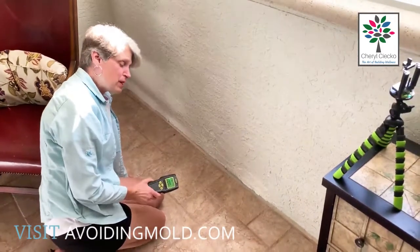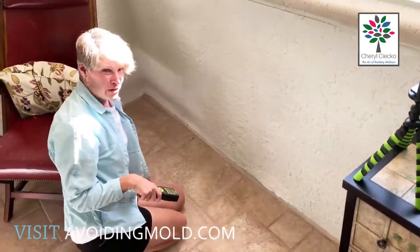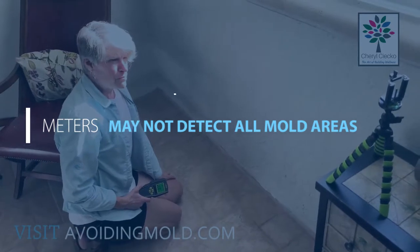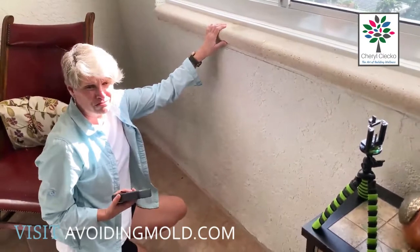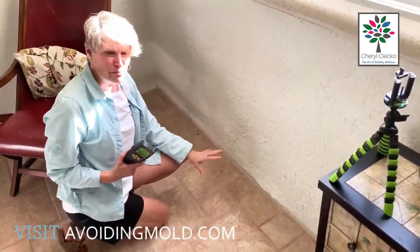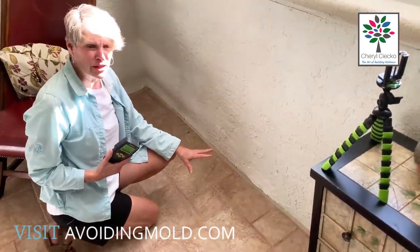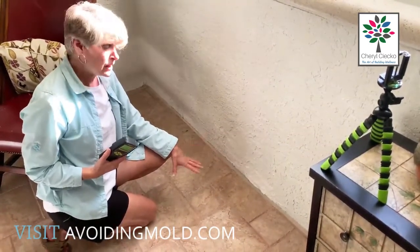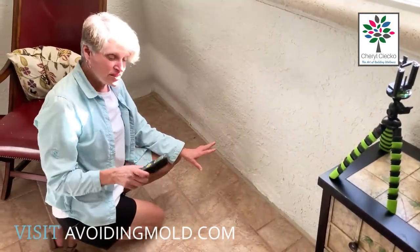Where this becomes a problem is when people have wood flooring on top of concrete, because under the wood flooring is an impermeable membrane of some sort that allows the wood to not take on moisture from the concrete. So if there was wood over this, it may not read significantly higher — it's really hard to test because of that impermeable membrane, which is often plastic or some sort of vapor barrier. And then we get mold growing under the vapor barrier.